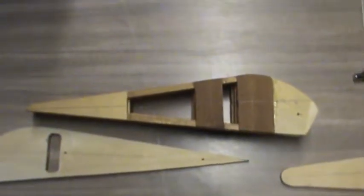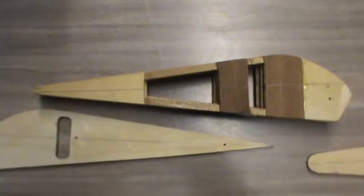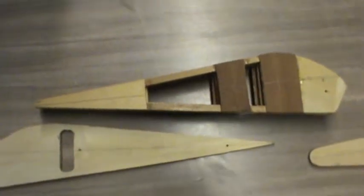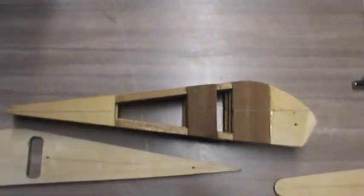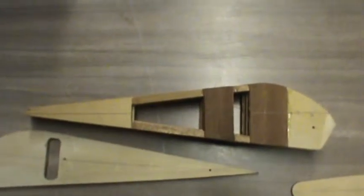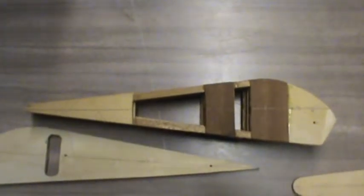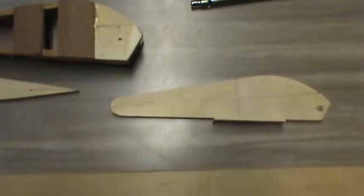And again, center lines are drawn on the wing spars and the ribs that make up the well opening. Now I have also gone ahead and drawn the chord lines on the aileron ribs on both sides, end rib, and the interior ribs. Now, I might occasionally refer to this as the center line, but it's not really truly the physical center line of the aileron rib. It's the chord line of the wing because of the way that the aileron is shaped, and it's shown on the plans that way. That's what I want to mark, because that's where it runs through the center of the centers up on the aileron spar. And then I know everything is in proper orientation as far as the chord line goes.